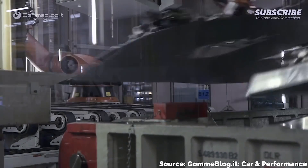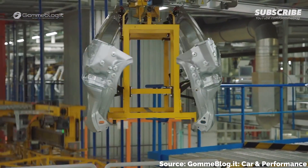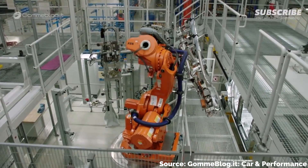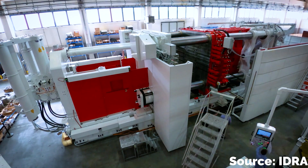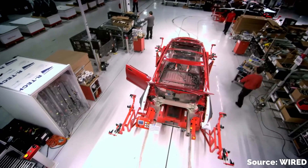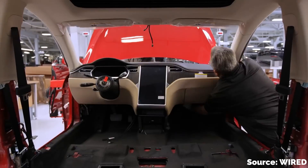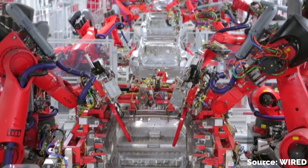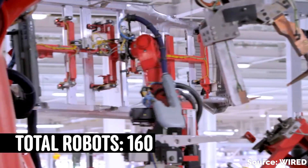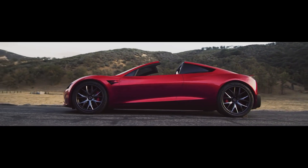The reason this compact hatchback-style Tesla would need an even bigger press than the Cybertruck would be if they're going to cast the entire frame of the car in one single motion. They would need an incredibly large mold filled with a ton of molten aluminum — all the liquid metal needs to move very fast to fill the entire mold perfectly before it starts to cool, but also perfectly smoothly with zero turbulence for a flawless casting. It's going to be a very complex process. But just imagine how lean the production line could be if most of the car popped out of a casting press in one solid chunk. Once Tesla becomes affordable to most people, most people are going to want a Tesla — and a car starting at $25,000 US could secure Tesla as the biggest company on the planet.